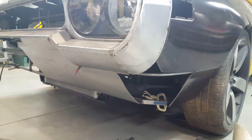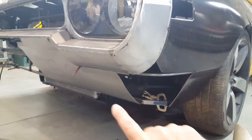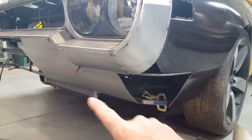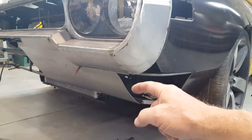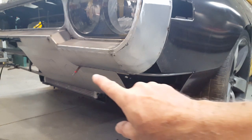I'm trying to finish out the corner of the fender and how it interplays with the roll pan. I've got the roll pan made up now, and it's just clecoed in place along this bar here in two locations. I drilled through the bottom and have two quarter-20 nuts, spaced out here. They're going to be about 16 inches apart across the entirety of the lower roll pan, and they're captured nuts welded on the inside, and then it's just bolted up from the bottom. That'll hold it here.